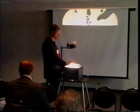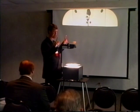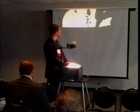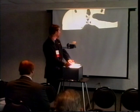The next thing we want to do is we want to check, make sure the banking pins are straight in all the way. Then we go to fork horn clearance. We want to make sure that fork horn clearance is going to allow the roller jewel and the fork horns, they have their safety action, okay?